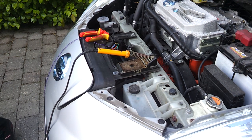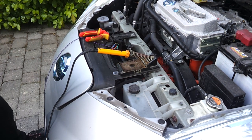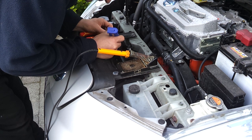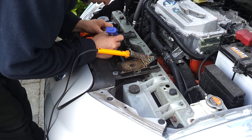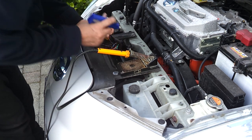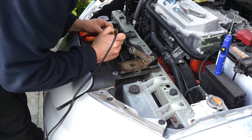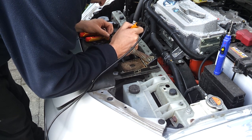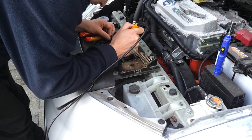So this is our blue wire on the LEAF — which is CAN HIGH — we're connecting that to purple on our tap lead. It still seems to go cold when I'm trying to solder this — it just doesn't have the power. Back to the original statement: don't buy that thing. They're just not up to the task. There we go — lovely job. Job done.